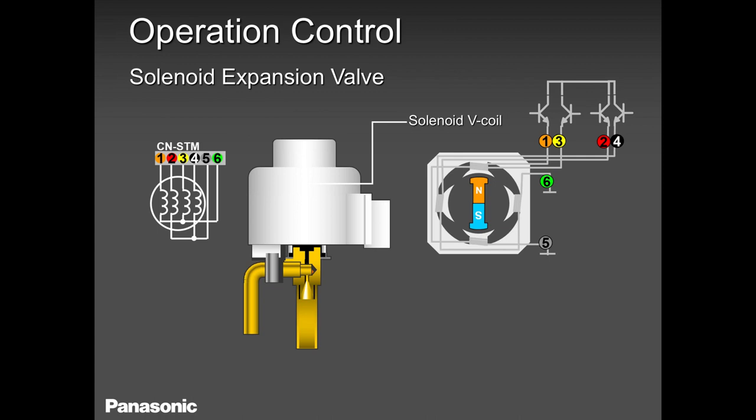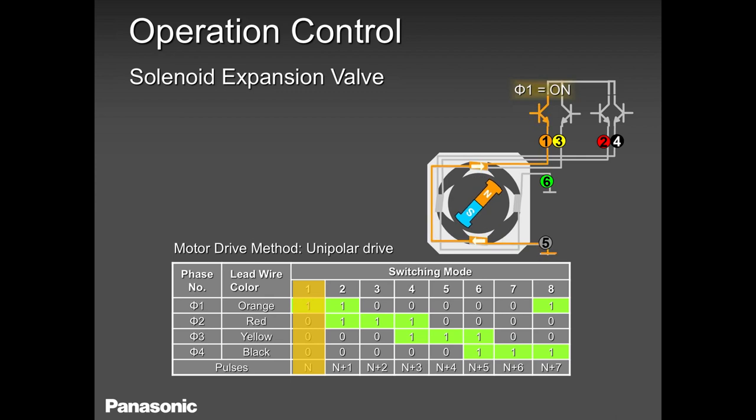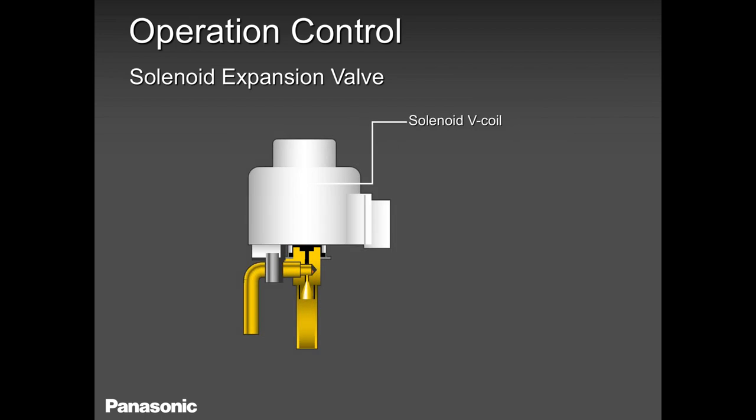Back in the day, it was a fixed orifice or a fixed capillary tube. Now they have become more creative, and it is controlled electronically, by the sensors at the indoor unit and the outdoor unit. When there is a requirement for more refrigerant, this electronic expansion valve opens a bit more, more and more. Once the room is satisfied, or getting to set point, it starts regulating and starts to close. Eventually it will close down completely and the compressor is going to go off.